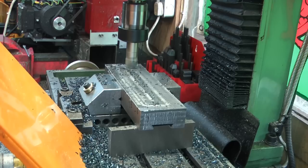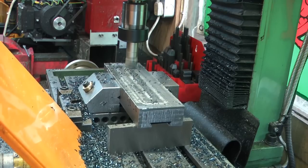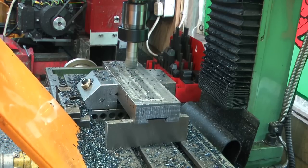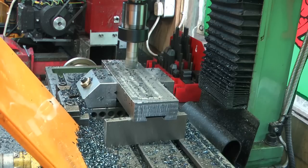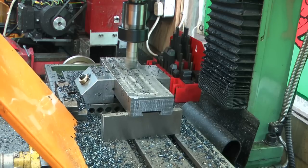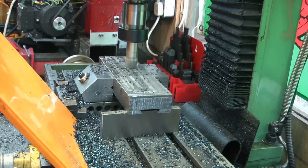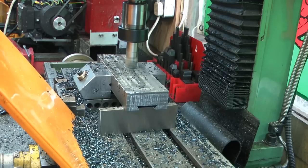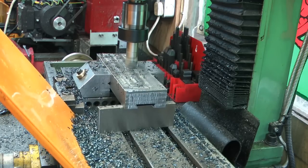I'll see how I get on with the fly cutter. I might do with swapping between cutters - I can only take about 0.2mm with a fly cutter, whereas with this one I can't take a full mil but I've been taking about three-quarter mil cuts. It doesn't take long - probably 30 minutes to take that eight or nine mil off there.